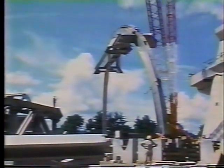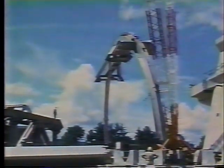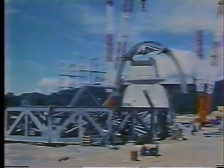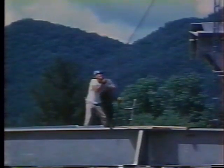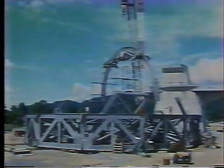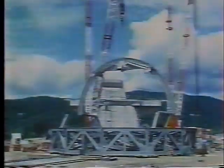counterweight box section. This 20-ton aluminum fabrication was lifted with ease by one of 2 large guy derricks, each capable of lifting 250 tons. Each hoist load line has 32 parts. Control is precise, in good hands. The girder holds the bronze declination gear and 36 tons of concrete and steel counterweighting.